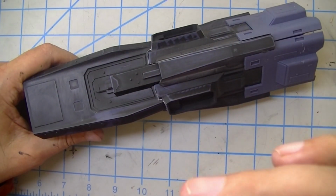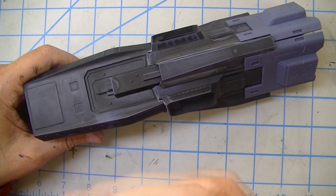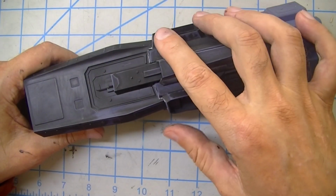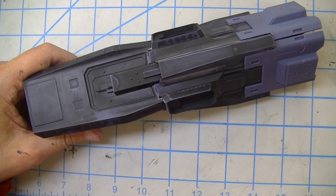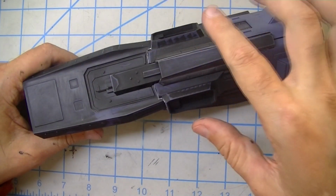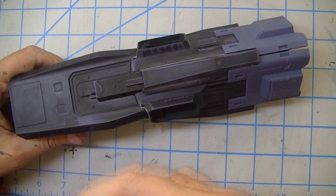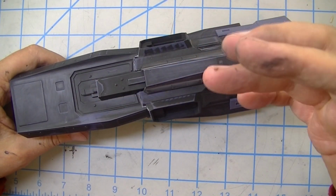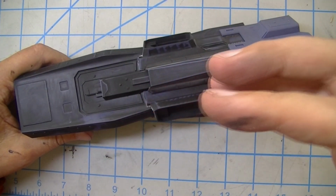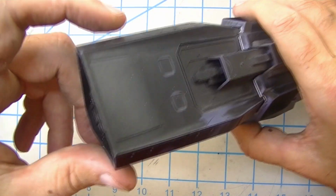But here's the problem. There's no guarantee that the person who prints the STLs for the master patterns that all the resin castings are going to come from is going to use the same resin, use the same machine, and orient the parts in the same way as all of these parts were done. You've got to have complete continuity through the process if you're going to make changes to the STL or to the CAD database that then translates through to the ultimate printed parts.